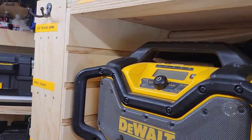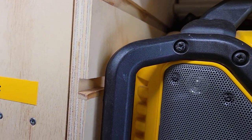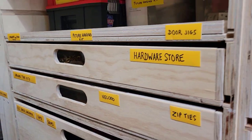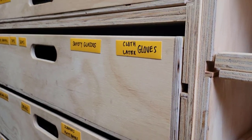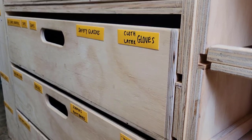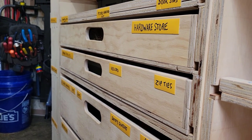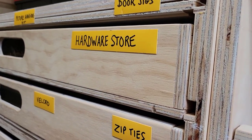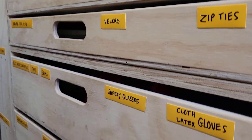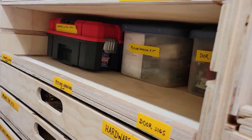All of these drawer slots or shelf slots are three and three-quarters apart — so from the bottom of one to the bottom of the next is 3 and 3/4 inches. This allows me to make two drawer sizes: a shallow or short drawer and a tall drawer. The tall drawer is literally just two of the short drawers. You can move short drawers down and a tall drawer up, so it's very modular. These short drawers are 3 and a half inches tall and almost the full interior width of the cabinet, less maybe a sixteenth of an inch for the drawer slide. The tall drawers are seven inches tall — full depth, full width.